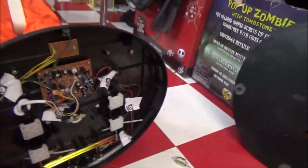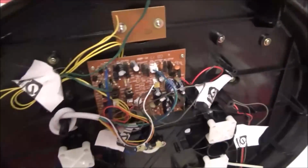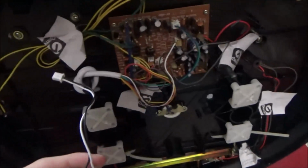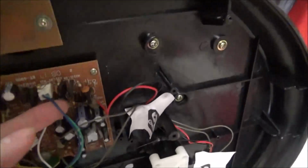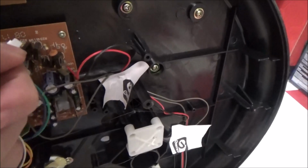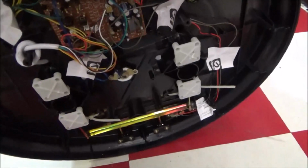Now here's an extremely good tip for when you're going into the electronics of these life sizes. Now some of them can be fixed, some of them can't. This one can, and I'll get to that in just a second. What I use is a test motor hooked to one of the harnesses that do fit into the plugs. If there are components or moving pieces that do not move on the item, I unplug the original harness, plug in this motor control, and then I test the item to see if it's cooperating correctly.